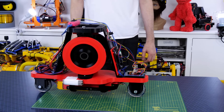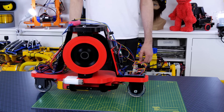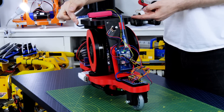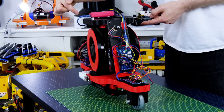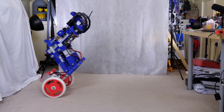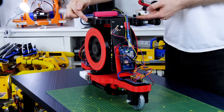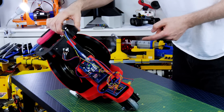And that looks like it's working - I can step away and leave it, and it'll also stay balancing if I push it. I added some metal weights to one side because the robot isn't perfectly symmetrical - the Dynamixel servo is off center and lots of other things. Now the robot's taller, it's really apparent that the gyros will creep and keep moving in one direction until they reach the end stops, then the robot will fall over. That's because they can only exert force when they're moving, so if the set point of the controller isn't perfectly set to the center of mass the robot won't stay balancing for very long. In the case of our gyro robot, which can't move sideways, the only way to balance off center is to constantly exert a force by constantly moving the gyros until they can't move anymore.